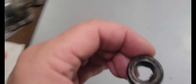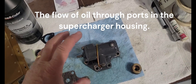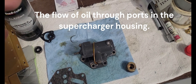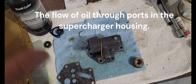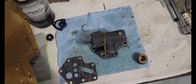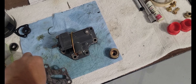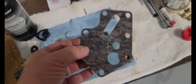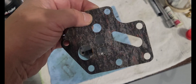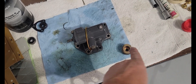We found some bad seals — that just wasn't going to fly. So we got some new seals and gaskets. All these do is redirect the flow to the supercharger so you can either get a low volume blow or a high volume blow. You generally use it above 10,000 feet. Let me get this installed and I'll show you how we go about it. The first thing I'm going to do is clean off the pad, put some grease on both sides of this gasket to help with sealing, then install the gasket, put this on, and get the control cable hooked up.